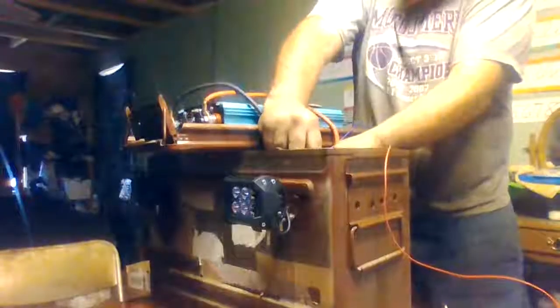A little bit more wire here. Way enough is perfect. And this wire that I purchased for these lights is actually a lot heavier than the light wires themselves that came with the kit. I don't know why, even with LED lighting. They may have next to no wires as far as wire size and amperage goes, but the further you travel it from your battery, you want to make sure you carry a good enough wire to hook it together to where you know it's going to hold and not get pulled apart down the road. These little wires are just so thin, they have a hard time making a good solid connection.